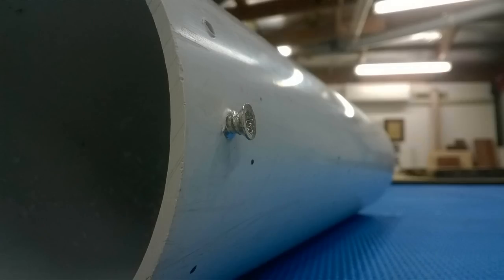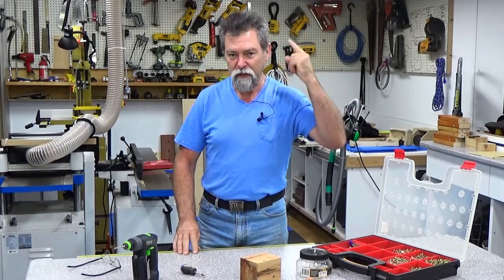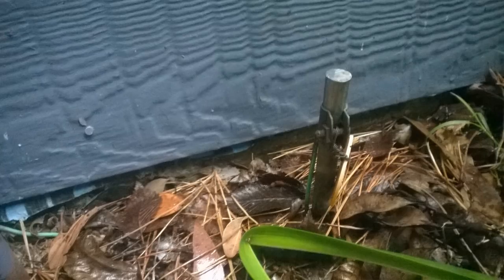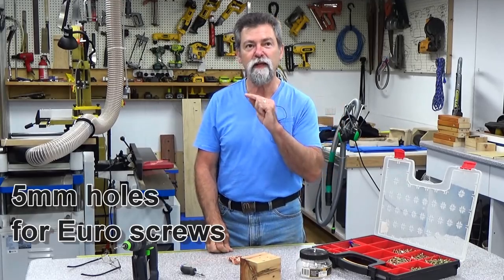I've created a series of lightning rods down through my pipe and earthed it directly to the impeller's shroud - the encasing that's around the impeller - which in turn is earthed directly through my house into an earth rod buried into the ground. To do that I've drilled a series of five millimeter holes.